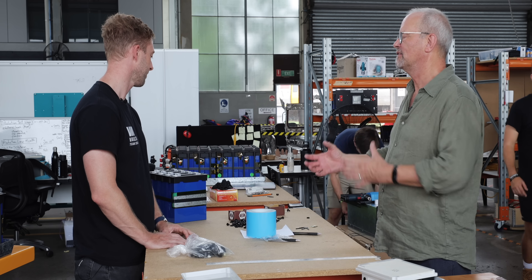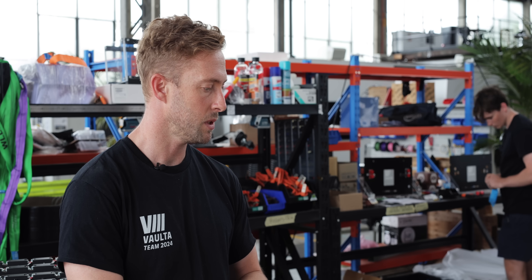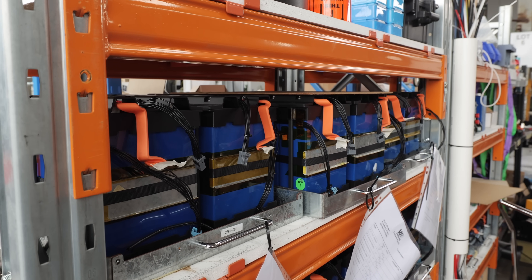It's not so much a cost differentiation. Cylindrical cells work really well for a high voltage application in a smaller package because you can build up the series connection for that high voltage. What we found is that prismatic cells are really well suited towards this application, particularly at a lower voltage — which is a 48 volt application. We found the cost of the cells is really effective here. You're less at the mercy of the US dollar or variations in raw material costs, which means you have a more stable priced product.